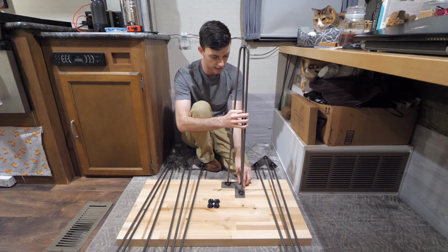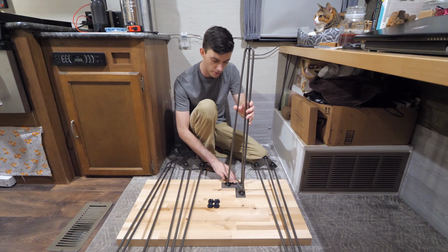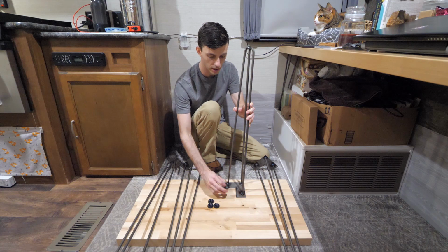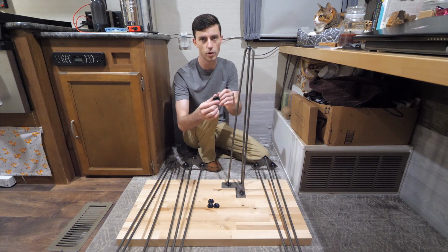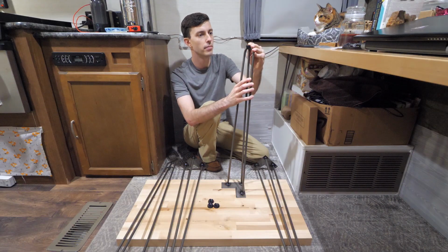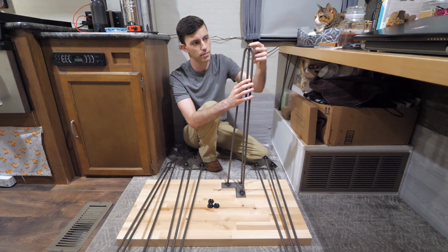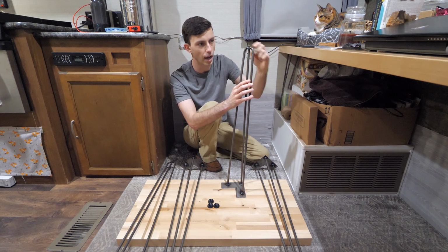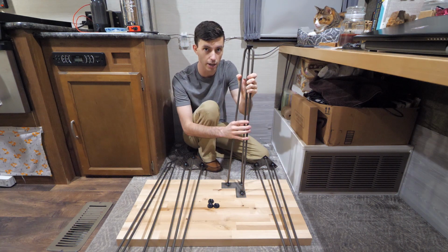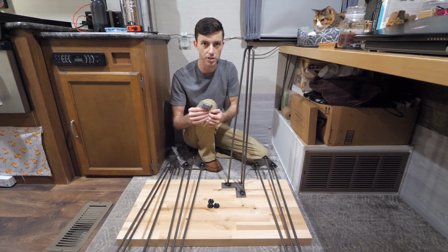And we're gonna put one of these on each corner of the table, inset roughly between 1.5 and 2 inches. And they also come with these little rubber feet that go right on the end there, just to give the leg a little bit of padding to sit on. So this real narrow round end of it isn't just digging into whatever the leg may be sitting on. These hairpin legs also come with all the hardware that is required to install them.